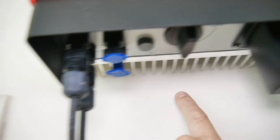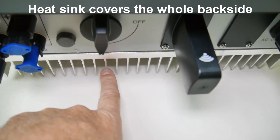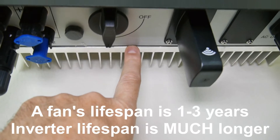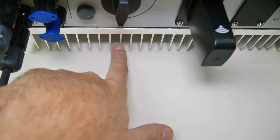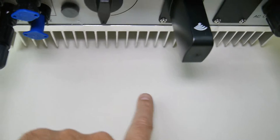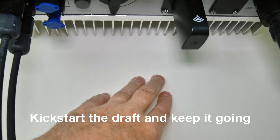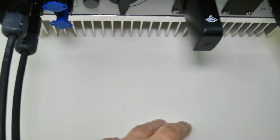This is the inverter's underside. As you can see it's got this massive heat sink under here. This inverter uses passive cooling — it doesn't have a fan in it. I wanted that because if you put a fan in there and the fan quits moving, this thing overheats, quits, and then you have to take it off the wall and into the dealer to have the fan replaced. If you just have convective cooling, that's better because there's no fan to wear out.